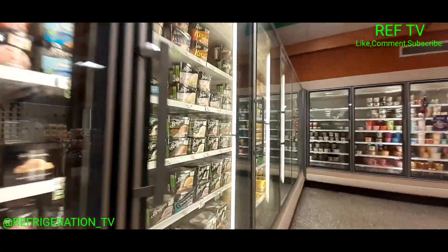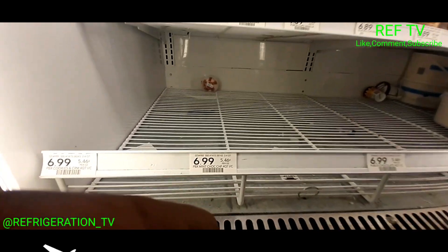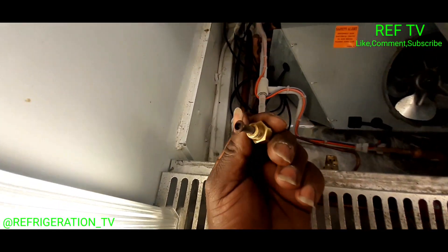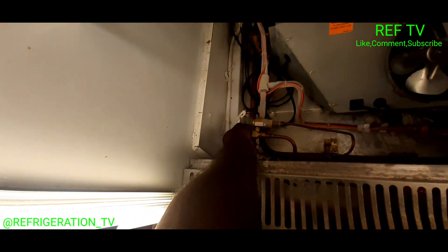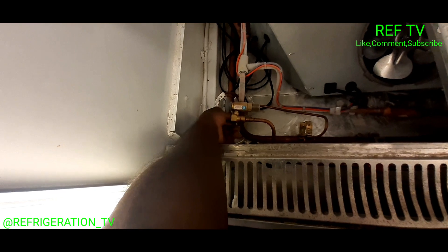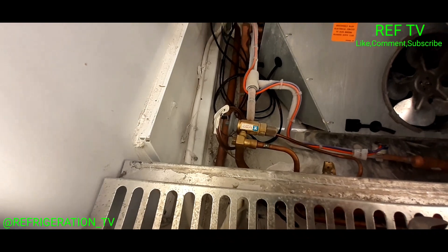Our fans kicked off again. Probably got a dirty screen in the TXV. This one is running, this one is not. We're going to check this TXV screen and see if it's clean. I just cleaned it — as you can see you can see through it a little bit. It is a bit clean now. I may have to pump this down and check the pins. I could check the superheat, but in this case it's been at 50 degrees for a couple hours, product's off — you've got a lot of moisture. We have to get this case down to maybe about zero to two degrees before we can actually check the superheat.